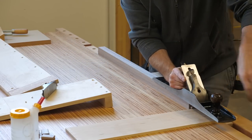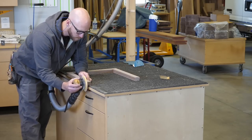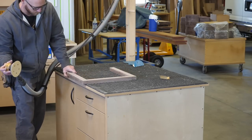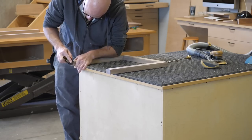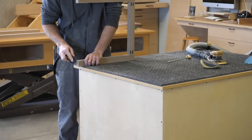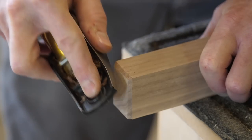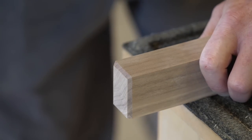Next is final surface prep. I use a hand plane for the bulk of the work, then I kiss all surfaces with sandpaper. I don't like to apply modern finishes to a planed surface, especially when the can of finish specifies that the surface be sanded. Finally, I chamfer all of the feet — I think this is a critical step to prevent wood from breaking out as the table is being scooted around.